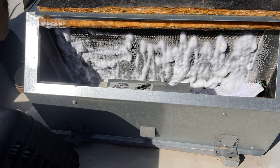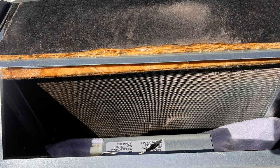The last thing I want to talk about is debris. You want to get an annual maintenance done where a tech cleans out all the different areas, because debris is one of the biggest reasons that things stop working. Furnaces, water heaters, refrigerators, and air conditioners all need to be maintained and cleaned. On the air conditioner, I find hair, dust, and little nests from bugs and bees. I vacuum out the area, use a coil cleaner and a brush to clean the coils.